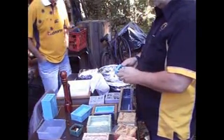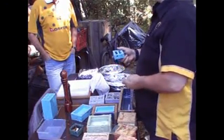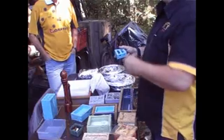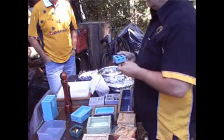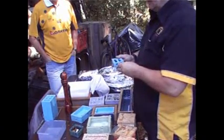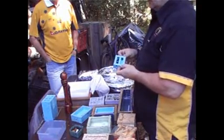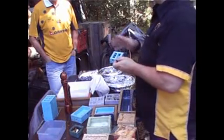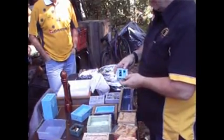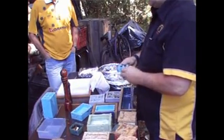These are cast in situ ones where you actually use the tube. You put your tube in there. This is for things like glitter casting, for labels, for watch parts, feathers and others. You actually got them on the tube, so you put the tube in there, hold your rubber stoppers from either end, and that'll seal it. And they work well, and the advantage of these ones is you can cast under pressure, but most times you don't need it. But as you can see, it's a soft rubber, so it can split, so you do have to be careful handling those.